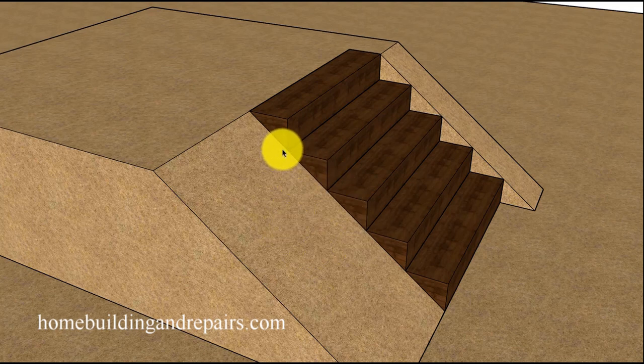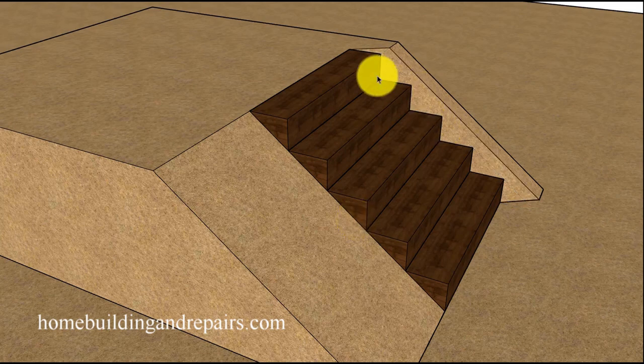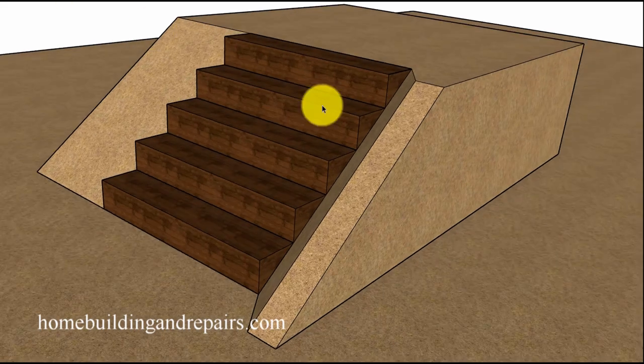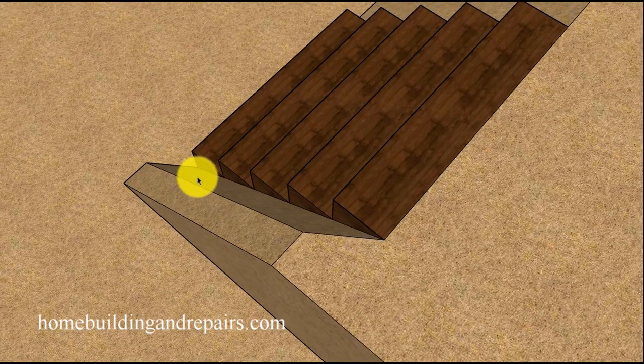Something like this is going to work. I'd actually suggest lowering the soil at least an inch — that's the minimum. You'd be surprised how much debris will wash down when it rains; leaves and debris start to collect and you end up with a little river running through and down your stairway. You may need to set up some type of drainage system, lower it even further, or actually maintain the stairway. You could also dig a channel so debris and water flow away from the steps.